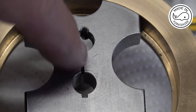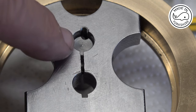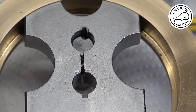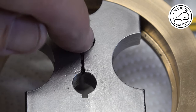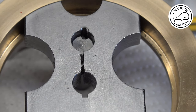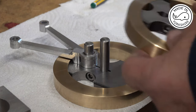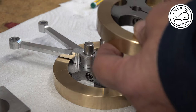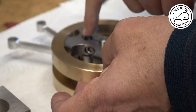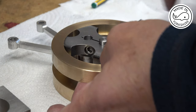I've cleaned everything up — the inside of the holes — and the crank pin is in there at the moment halfway in. When I drilled the holes for the grub screws I put a witness mark on one end, which is on the other flywheel, just so I know which way around the crank pin goes. I'll put a little bit of loctite on the face, push the crank pin in, then tighten up the grub screw. I've put this pin in as a guide on the centre hole — don't forget to put the conrods in — and I'll slot that over and down. The crank pin is just starting to come inside, so I'll put some more loctite 638 in there, press it in, then put the grub screw in and that should be it.